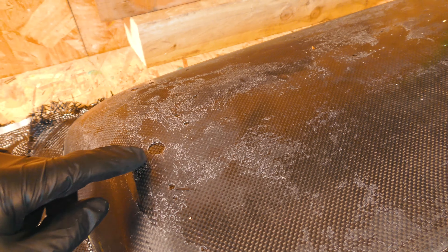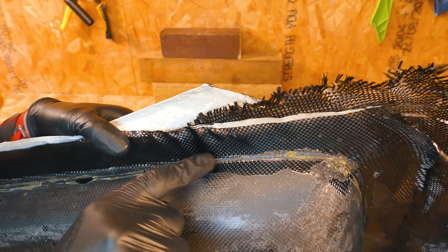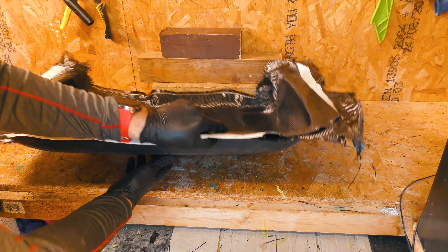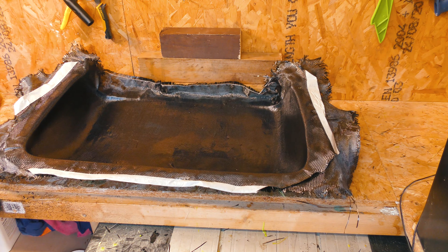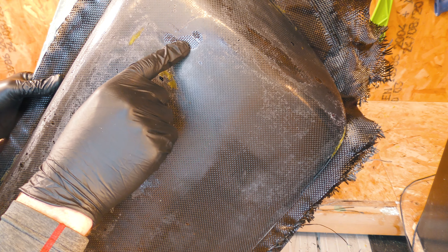The disadvantages of wet layup are quite apparent, because there are some gaps in the epoxy. No matter how much rolling I did, I'm still getting gaps. There's going to be some smoothing needed. I don't know what's going on here — the resin's there, but I wonder if it's cracked off on the bottom of the mould. The mould's good. That's quite a big hole in the resin there. I wonder if that is why I would need to vacuum bag — vacuum bagging it might be the only way to solve that.